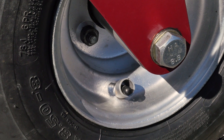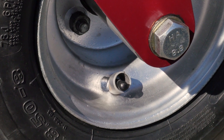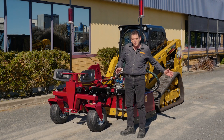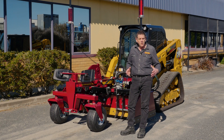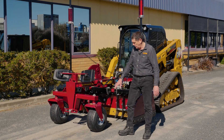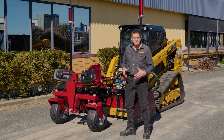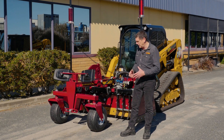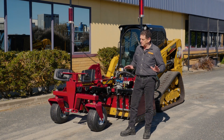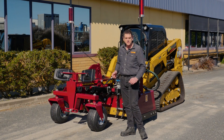We also have our valve stem protector on all of our Sharp Grades. We put a protector around the valve stem because most punctures happen when you're pushing through a pile of material and you get aggregate caught between the wheel and the housing. We protect them so they don't get ripped off, allowing you to run pneumatic tyres. Solid-filled tyres become very rigid and at speed they start bouncing, so we run pneumatic tyres and valve stem protectors so we can grade at speed without bounce.